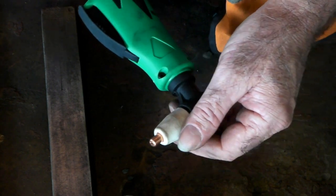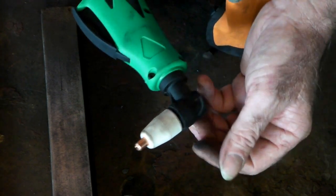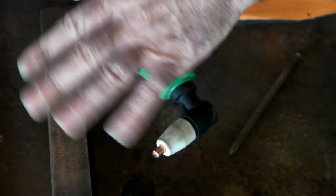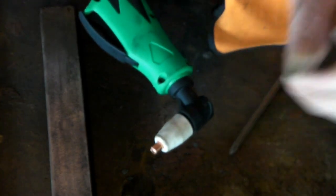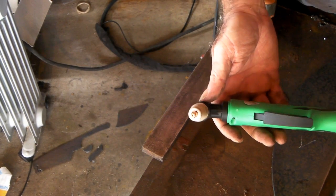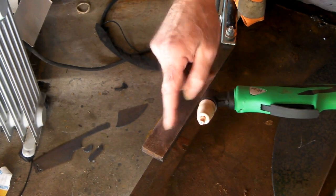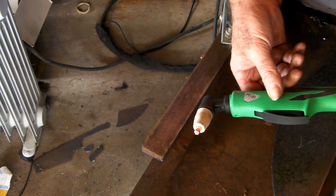I've had this little idea that I've been using for the last couple of years and it seems to work perfectly fine on this sort of torch. I can't see any reason why it wouldn't work on other torches either. If you just want to dig out a little hole or do something in steel without cutting right through it, watch this. Here's my trusty torch with just a normal PT31 consumable in it. I'll show you what happens when I try and gouge — it won't gouge, it'll try and cut it.